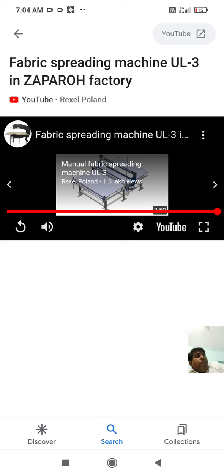So the pattern defects are: the pattern parts should not be missing. That is one part. The parts should not be mixed. Patterns should face the correct direction. All patterns should face the same direction. Patterns should be aligned with respect to the fabric grain. Line definitions should be perfect, which should lead to accurate cutting. Skimpy marking.